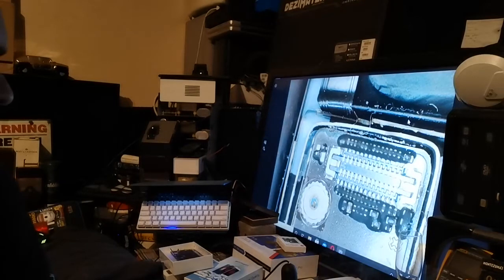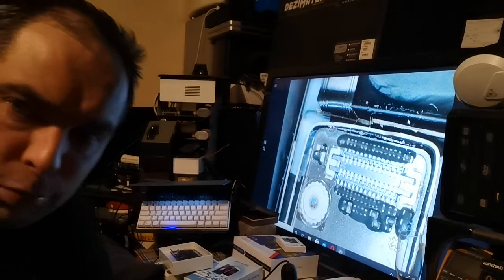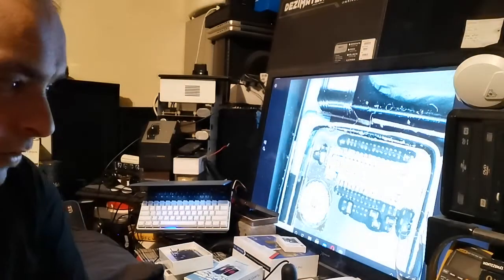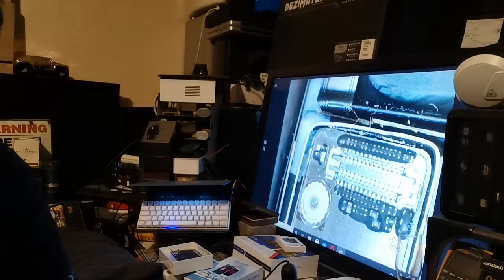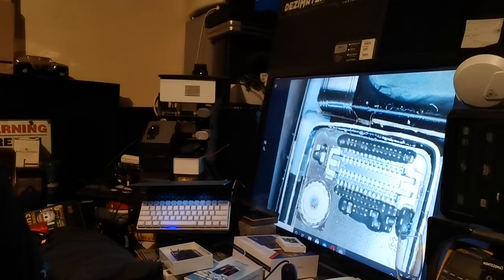Right, now the other things I'm going to need as well is low temperature solder paste and BGA flux paste, particularly for that make and model of board which I don't have. Because, surprise, surprise, I haven't done any work on these particular phones before. The XS Max is new, to me at least. It's a bit of a bad situation to be in, really, isn't it?